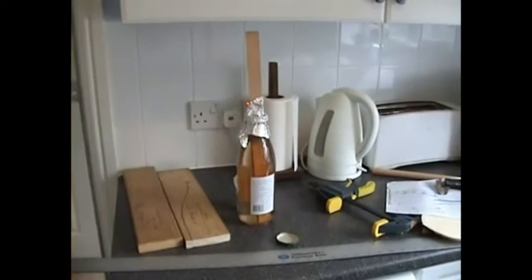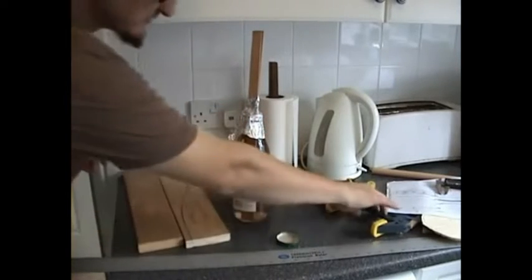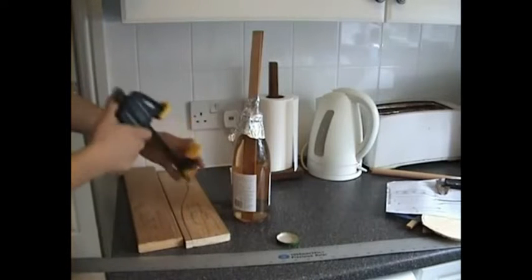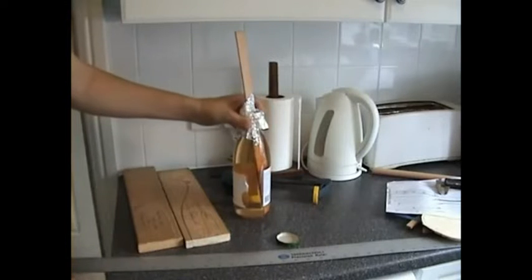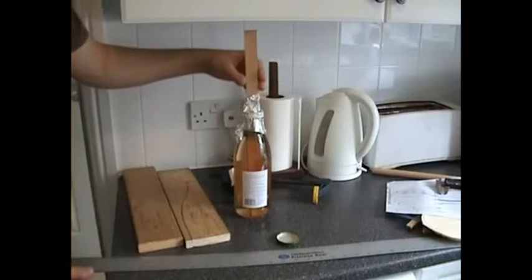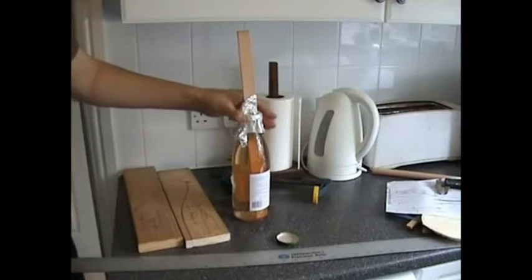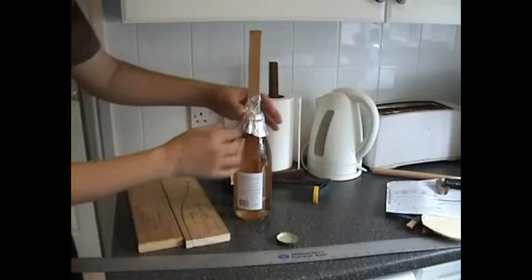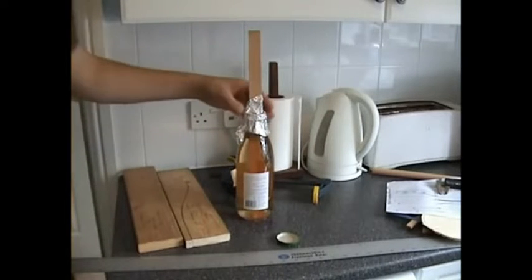Okay, it's nearly time. Okay, we'll just check we've got our clamp ready. Okay. You notice the water's turned slightly orange, and that's the staining from the gum that's in the cherry wood. Different woods will have different colours. This is one of the disadvantages of the method. If you have a very highly coloured piece, you can lose some of the colour from steaming this way.